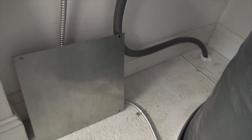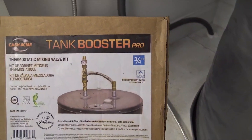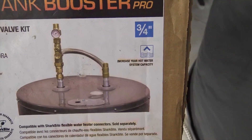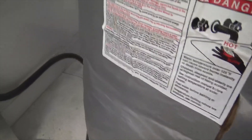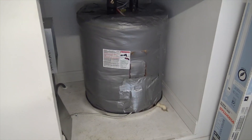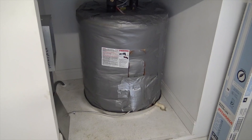This is the tank booster kit in case you're curious — it's a Tank Booster Pro, three-quarter-inch version, that sits right on the top of any standard water heater. It allows you to turn your water heater into a little more thermal storage — about 20 gallons more hot water, depending on how hot you mix it down to. Alright, that's it, so we're going to load up our tools.